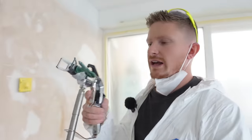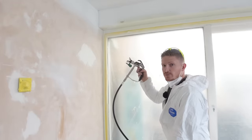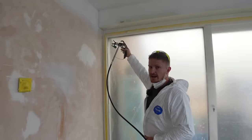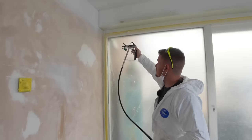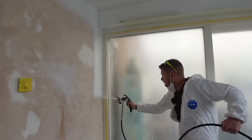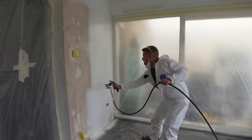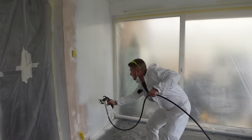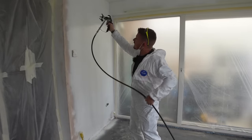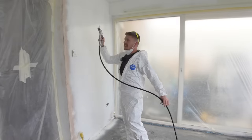Let's move on to the walls. I'll put the normal nozzle back on now. Switch it to the vertical position so that we can work up and down the wall, just like you would with a roller, starting with the corners just like before. Keep that gun moving as you go — if paint is going to bunch up, it's more likely to happen in the corners as you move around in those more intricate positions. Don't tip the gun over or twist your hand; try to keep square onto the wall. I tipped my hand a little bit there — what that does is bunch paint up at the bottom of the spray pattern and make it thinner at the top. So even after hours with this thing, you still forget.